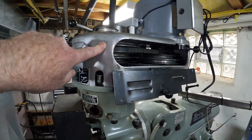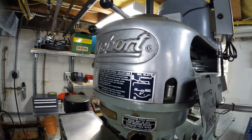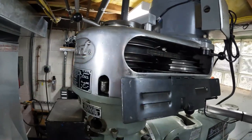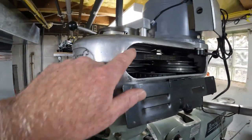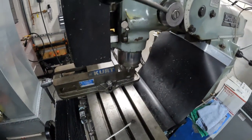That would work great in high speed because the front pulley is at the speed of the spindle in high speed, but in low speed there's a gearing that takes place and now the pulley is no longer the speed of the spindle. So that would be bad.